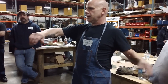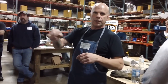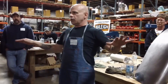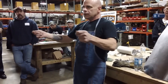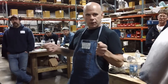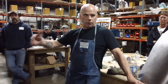You can take a large panel and run it through like this if you had to. With a wheel, if you don't have somebody on the other end, it'll take that shape as it dives off — all of a sudden you end up with a fender when you really wanted a hood panel. You have to have somebody on the other end who knows what they're doing and tracks with you. Teaching that to somebody on the other end, letting you be the driver, you can control it and they can start to learn.